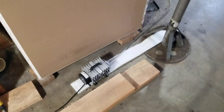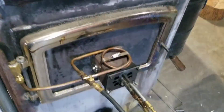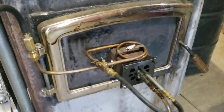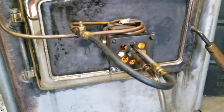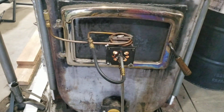The oil drops in and goes into this injector nozzle. I'll fire it up now — I basically have my compressor on a switch. I turn the compressor on, pump in air, go to the front, and turn on the oil. If the wood is going it will ignite it; otherwise I just give it a quick little torch, just like that, light it, and now she's burning used motor oil.